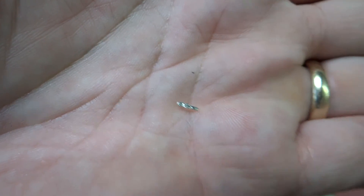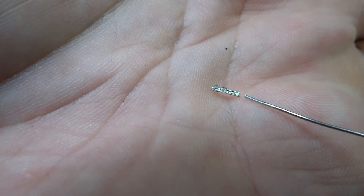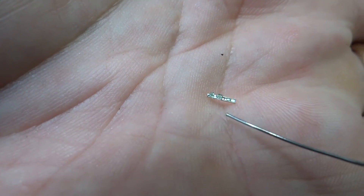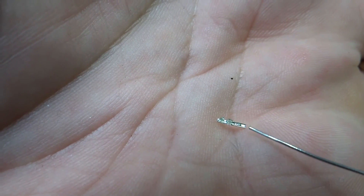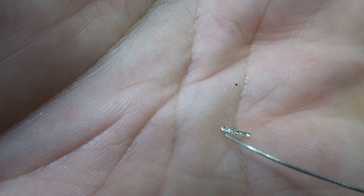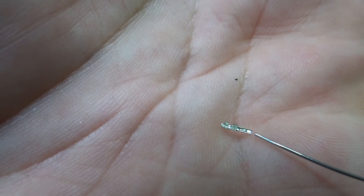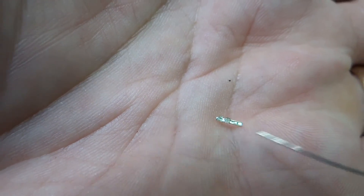One more important thing: I can use this solder as a pointer. You can see the connector fin at this end — the fins we cut off are over here, and the tip of the connector has a little brush contact on there. It's extremely important not to get any solder into that brush contact, because it actually flexes when you plug the connector in, and that's how it makes contact inside. If too much solder wicks into that tab, it'll solder it in place, and then it won't push into the connector.